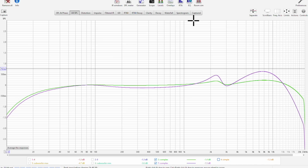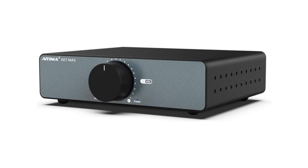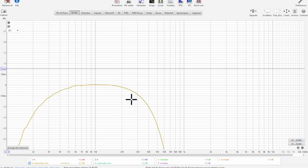With other amplifiers the variability may be much more significant. Comparing the complex load on the A70 versus the Ayima A07 — which is a more load dependent design — the A07 in purple shows swings of over half a decibel, which is more likely to be audible than the A70's lower swings of about 0.2 decibels. Earlier I mentioned the subwoofer's variable crossover — here it's shown set to maximum and then set to minimum.